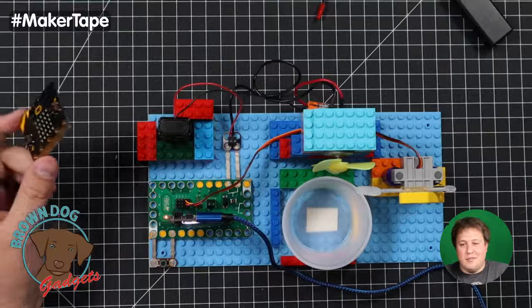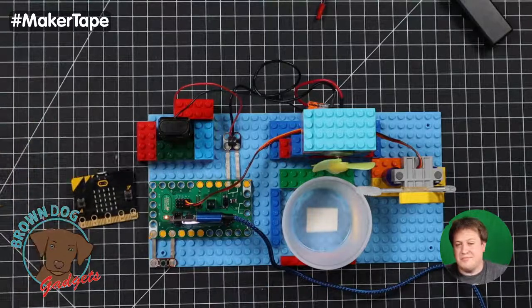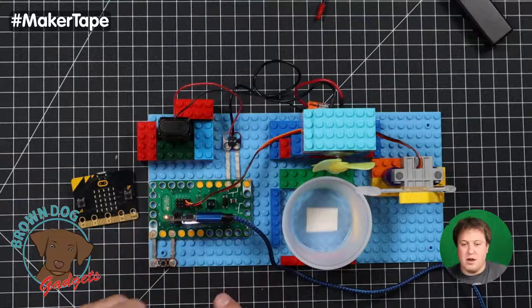So, Josh, the fun thing about the servos is you can power 1 or 2, maybe 3 from the built-in, with nothing extra. If you wanted to power more, you just have to add an external power supply powering the servos at between 3 and 5 volts. If you have a project that big, adding a couple extra jumper wires isn't a bad thing. We'll probably do up a guide that shows that too. We know 2 works reliably well, 3 works okay. After that, for whatever reason, our setup just isn't awesome for it. More than that, but that's a lot of servos.